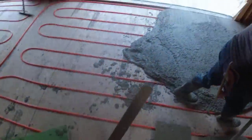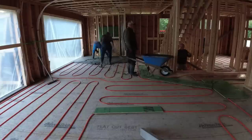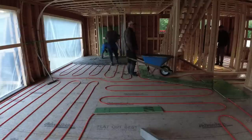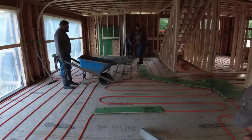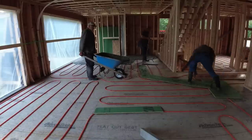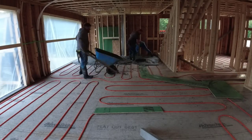Let me explain again what we're doing here. We're pouring an inch and a half of concrete over the first floor deck — we've done hundreds of these this way. The main reason for the inch and a half is just to hold the heat from those tubes. They're going to pump hot water through those tubes, that'll heat up the concrete, and the concrete will hold that heat and eventually radiate up and heat the house. Over there in the corner I'm mag floating the concrete even with the top of the first sill, so that inch and a half sill plate the wall stands on is what we're going to match. They said they're going to put tile over everything, but you could put any type of floor over it really.